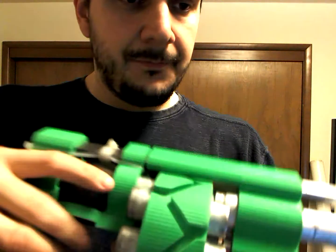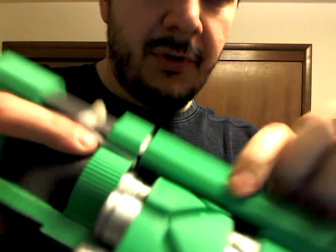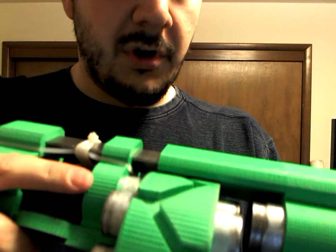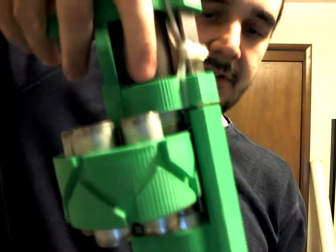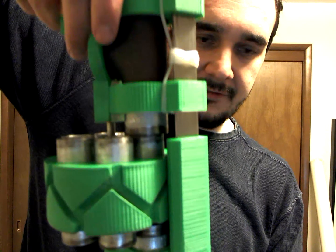Let me show you the action. So it starts out here, fully compressed, with the gas seals on the front and the rear engaged. As you pull out, it'll disengage one of those gas seals — if I aim it down, it'll disengage the back seal first. It doesn't really matter what order it happens in, but they will both disengage. There's a pin up inside of there that rides in the track that actually turns the cylinder.